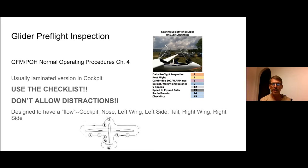Secondary surfaces, your flaps or spoilers, the big thing here is to try to get things symmetrical. If it's a case of spoilers, you can always slip to land to lose altitude. Good reason to keep practicing those from time to time. But if you have one stuck up and one down, oh gosh, I don't know. The aircraft's probably going to be yawing like crazy. If both are stuck out, or that's the only way you can get them symmetrical, just realize your glide ratio is going to be horrendous, so it's going to be a very steep approach and probably a very firm landing.